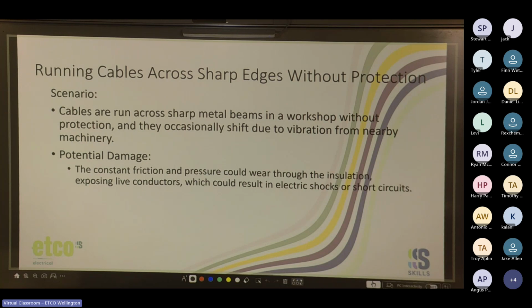Steel frame buildings should always be bonded. They should be connected to earth. So if a cable breaks, sometimes it may be too high resistance, the combined phase and earth circuit, but hopefully it'll break through the earth at the same time. I know it's not a good thing, but what can we do to prevent this?